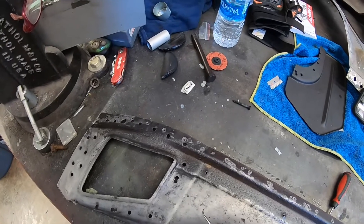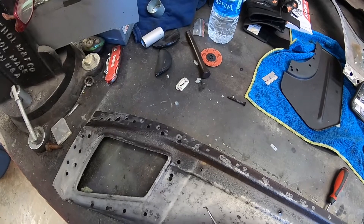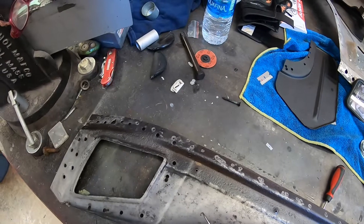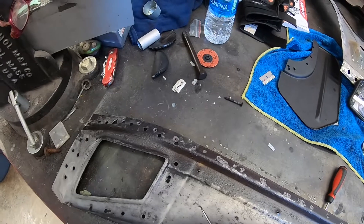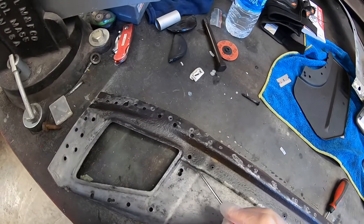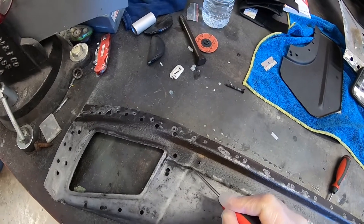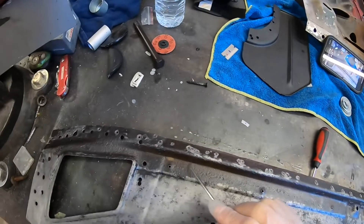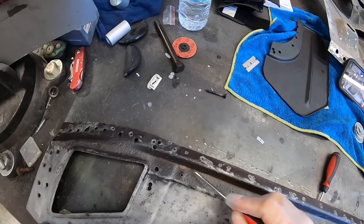So when you wash this off you're gonna have an etch — a rough area that the epoxy is supposed to adhere to. It seems more mechanical: it chemically etched it, but it's still grabbing mechanically, because you're washing all the acid off. The key is to make sure you clean all this acid off. But now over here I see a little bit of orange — yeah, a little orange under there. This orange starts here and goes all the way across, so very likely it just didn't get all the way down in there.